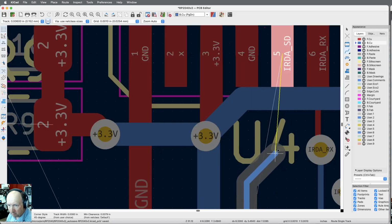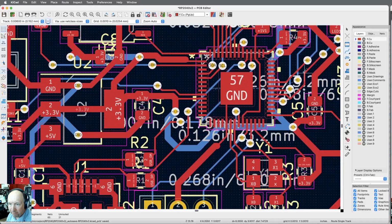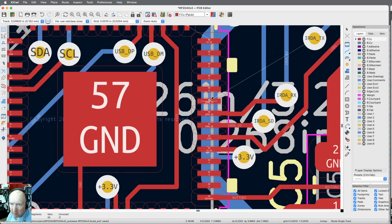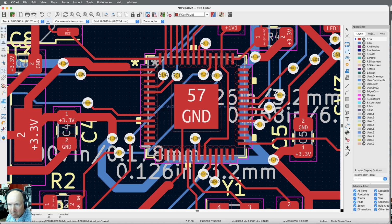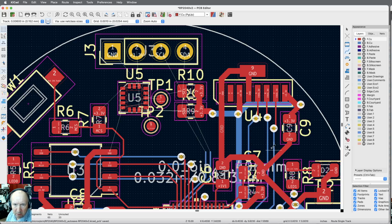Okay, so I just need to come in here for a via. Okay, so that one's done, but we broke something down here. Lots of room up here, so I'm going to take that spot a little bit. Let me just delete this trace and that one. Let me draw this next one in as close as I can, and that leaves plenty of room for this guy. Okay, down to 20. So that's all looking fine and dandy. That just leaves up in here. Shouldn't be too tough.